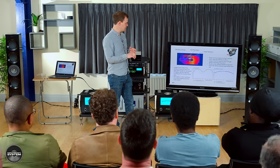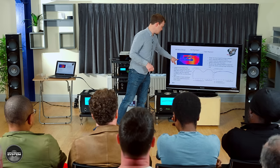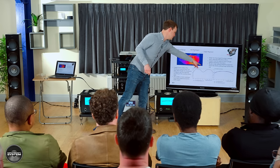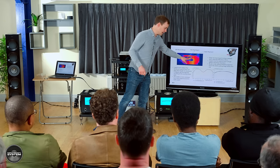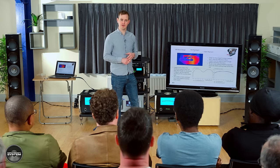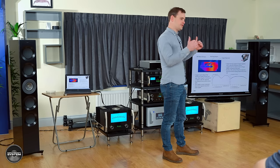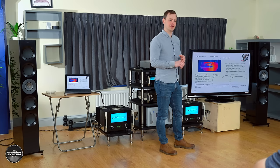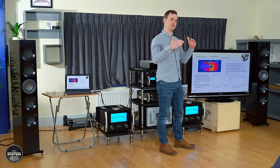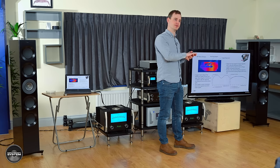And we've done something a little bit unusual here, where we have a gap in our motor system. So what you can see here is here's the outside of the driver, and here's the tube that goes to the tweeter. The voice coil is in here. And we've split this magnetic circuit into two halves with a gap between them. So when you look at the magnetic field that's around the coil, it's actually got a dip in it. That gives us an interesting opportunity then to control how wide we make this gap and how deep that dip is. And what we found is that we can use that to make the strength of the motor more constant as the coil's moving backwards and forwards. So it gives us an extra parameter we can optimize.